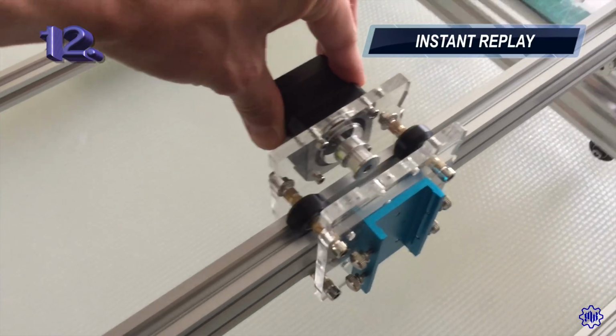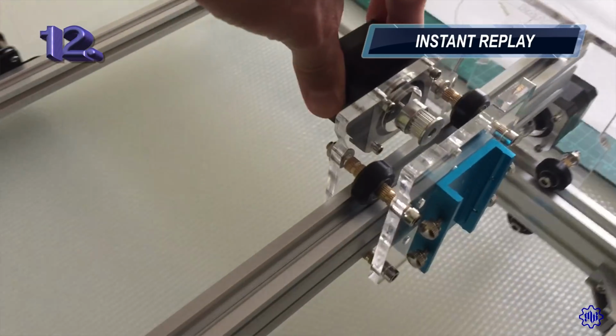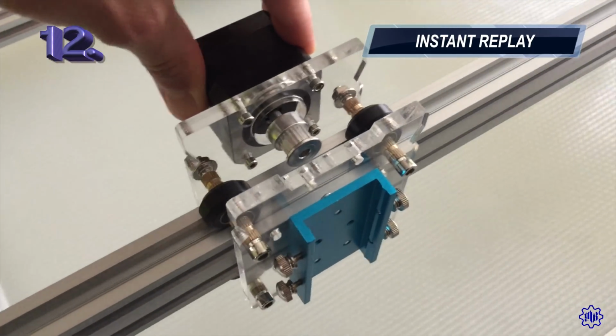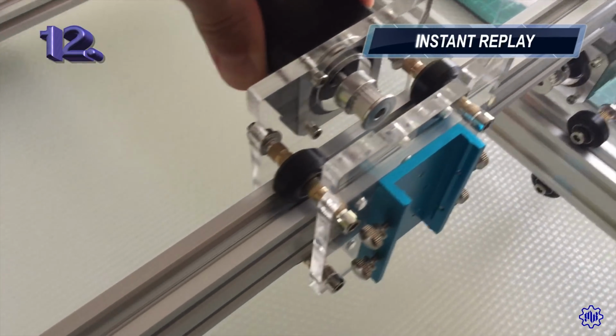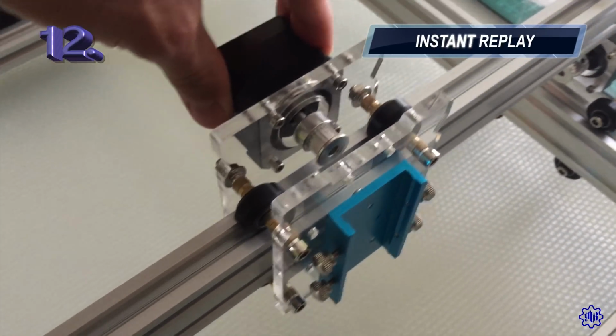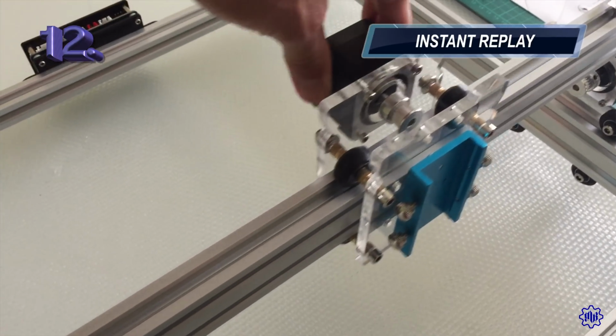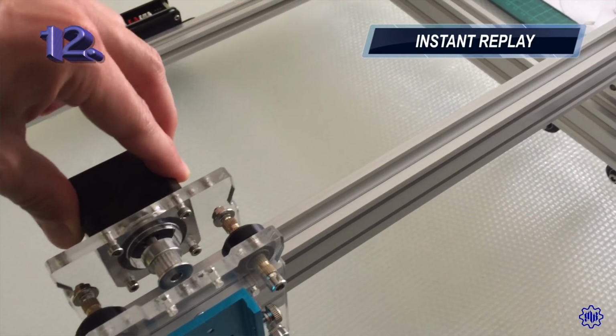If the movements of the trolleys are difficult, perhaps with noisy production, do not worry, it will be enough to loosen all 4 screws that secure the wheels, then tighten them again, and the problems will be resolved. Try to move all the axes, until you reach uniformity and fluidity in the movements.